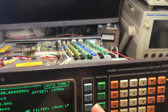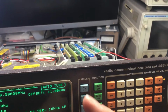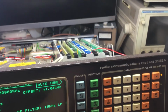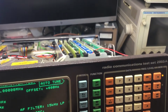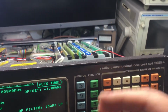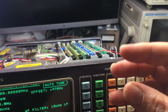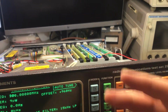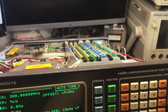And then the outputs of the FM discriminator and the phase modulator discriminator are on the top circuit, and on the bottom circuit is the AM discriminator, insofar as the diagram's concerned, which I'm going to show you in a moment. They're all fed the audio outputs after they've gone through amplification and filtering, and then they go into the discriminators themselves that demodulate the audio content from the 110 kHz IF. They're then fed into logic switches, audio switches, which are controlled by the logic circuitry.